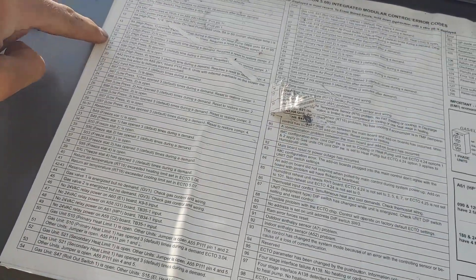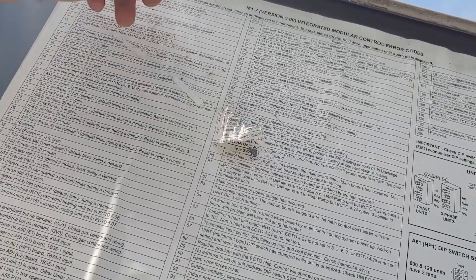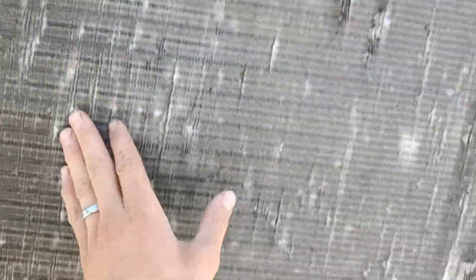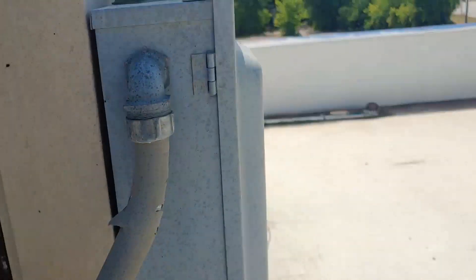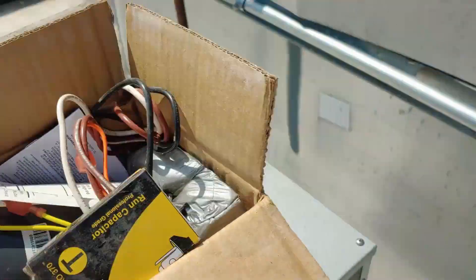Code 13 corresponds to S4 high pressure open during a demand on heat pump or just compressor, and that meant that the condensing unit got too hot. I cleaned this condensing unit about a month ago, so I knew we weren't having trouble there. We fired the unit up, hopped up on top, and the condensing fan motor on this side was not running. I already took the top off, removed the blade, got a replacement motor, and we're going to show you how to put that in quick.